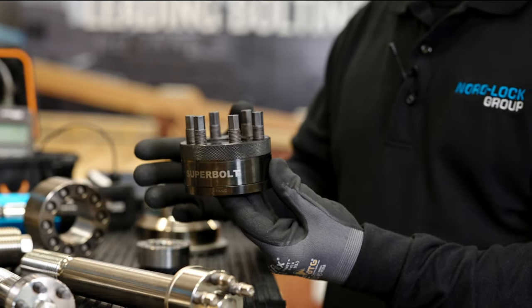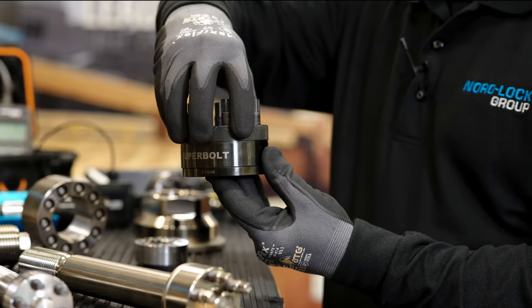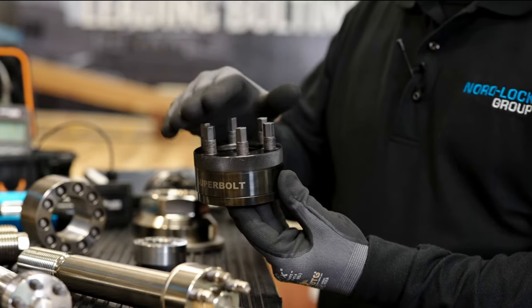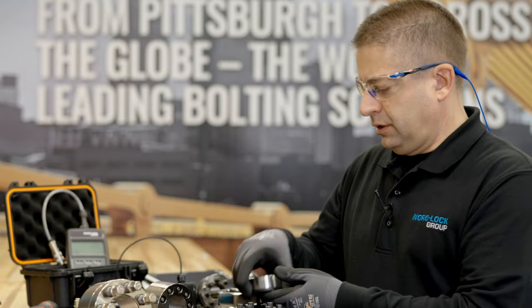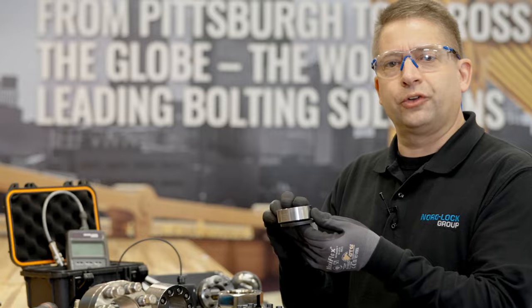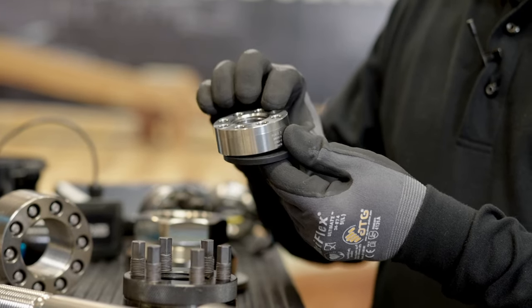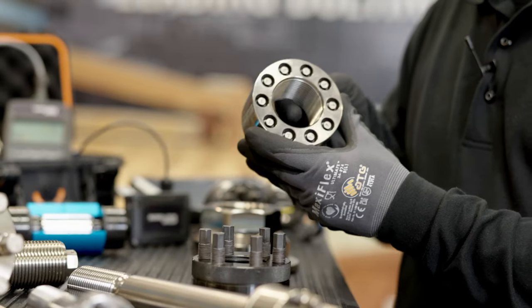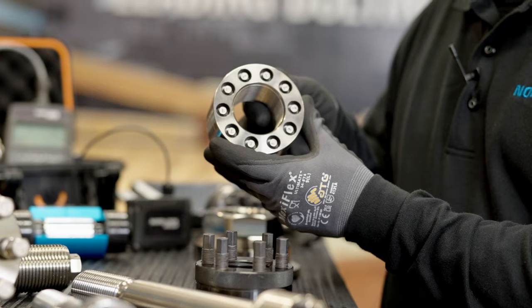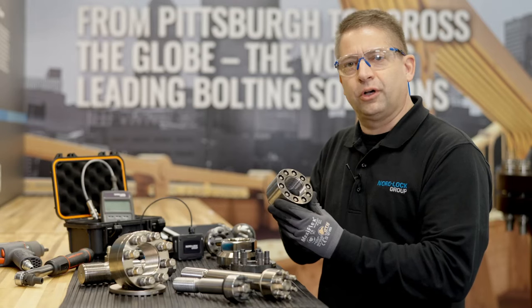It has further enhancements of a protective coating, a grip layer, and a reduced number of jackbolts, yet still maintaining the same preload capability. Here is a low profile tensioner called SJ for applications with limited headroom or thread engagement. And this is our MRA tensioner with captive countersunk jackbolts, protecting it from harsh environments. And this is also good for rotating applications and so on.